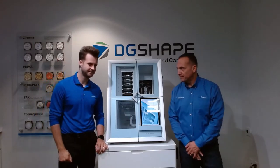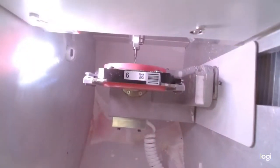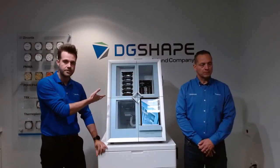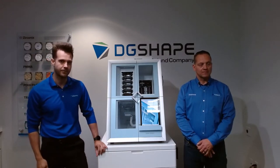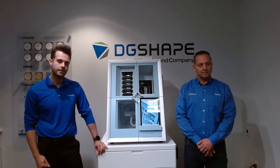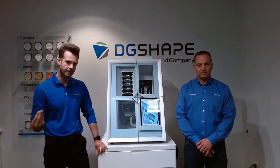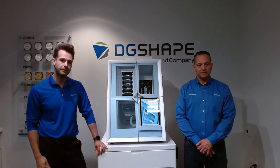With the faster PMMA milling times, we've reduced the time to mill PMMA dentures from about 4 to 6 hours down to 2 to 2.5 hours. Essentially, if you have the entire library loaded up with all 6 pucks, you could be saving up to 12 hours per day in denture milling time with the DWX-53DC. Not only that, but the collet is 3 times stronger. The tooling that comes with the machine has a sandblasted shank that allows for much easier grippage from that collet, less slippage, and more accurate PMMA restoration milling.